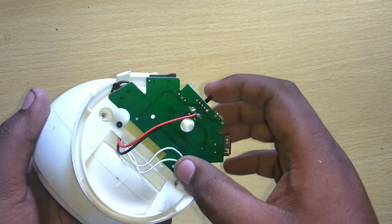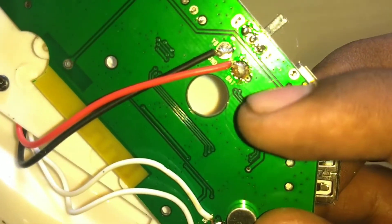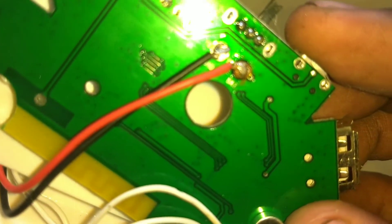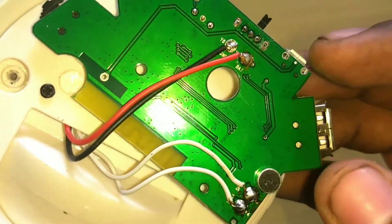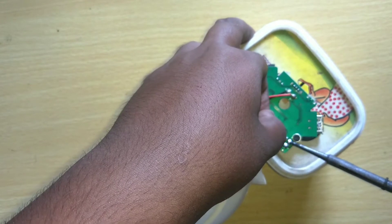You can see there are two wires — red and black — coming from the battery inside, and there are two white wires which connect to the speakers. Now listen carefully: what I will do is connect a switch in series with the speaker and also attach a 3.5mm jack in parallel with the speaker terminal.